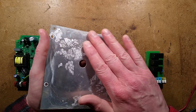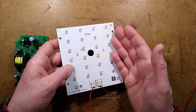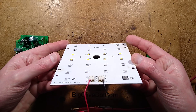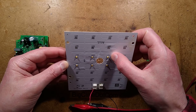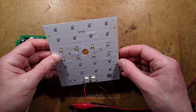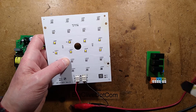The circuit board here — you can see slight corrosion on the back. This is an aluminium core circuit board: it's got the aluminium panel, then a shim of fibreglass, then the copper. The fibreglass insulates the copper from the aluminium, and then there's the solder resist, but they've used white here as a reflective coating. You can see the bubbles — the material has delaminated from the aluminium. Looking at the side, it's spread out to an area with no copper, which definitely confirms delamination from the aluminium.